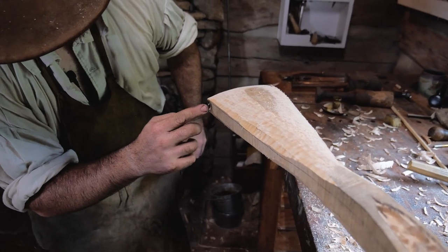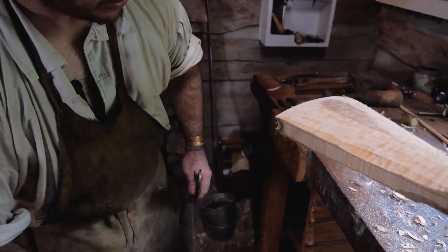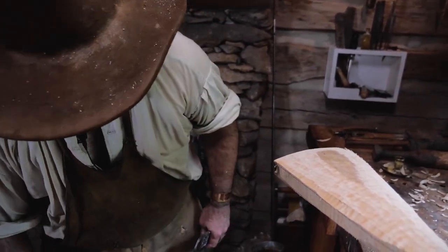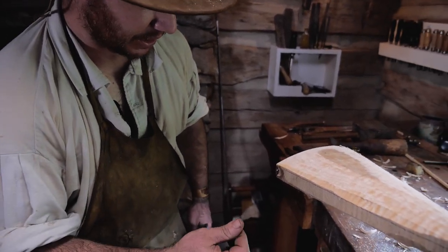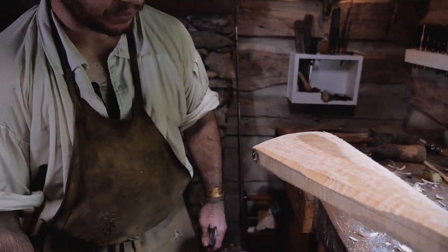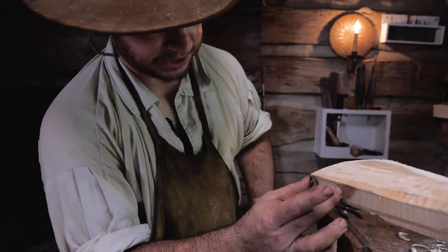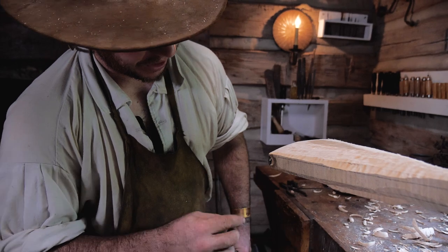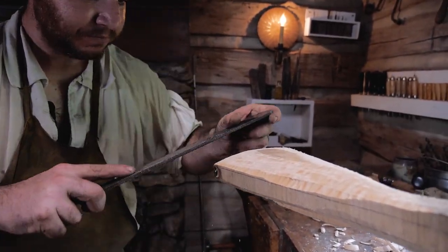So when I was beating that butt plate in, I took a gouge out of the toe right here, and that was a sure dang it. That kind of stuff makes me sick, but it sure happens. To fix that, you could take that piece and save it and glue it back and even drive a little pin in it to hold it. But what I'm going to do is cut out a design toe piece and inlet it in here. It'll hide that, and also protect it, and keep it from chipping in the future.